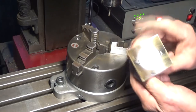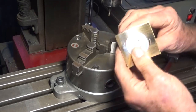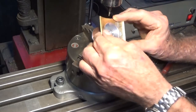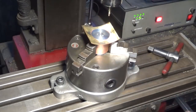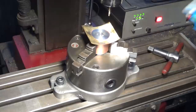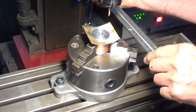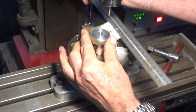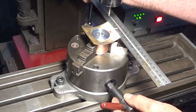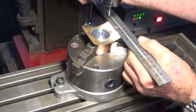I've put an aluminium slug inside the copper tube to prevent it from being crushed — it's just a press fit. It's got a flange on this end and I can rest that on the body of the chuck. What I need to do is align this square edge with the Y-axis of the mill. I'm using a big square and taking that off the back of the column. You're probably saying we should sweep that with an indicator, but this edge was just cut with a hacksaw so it's not particularly accurate — this is just a guide. I'll check that again when the camera's out of the way, but I think I'm pretty close.